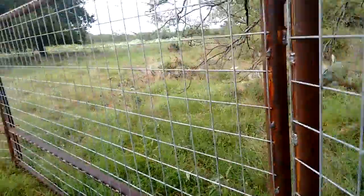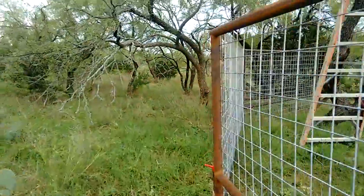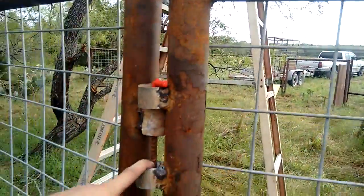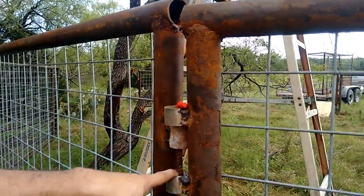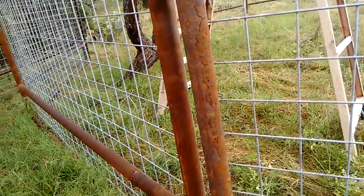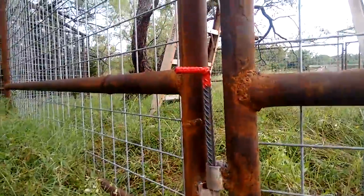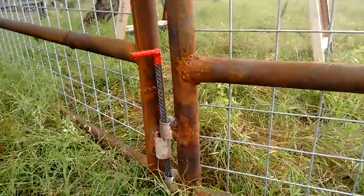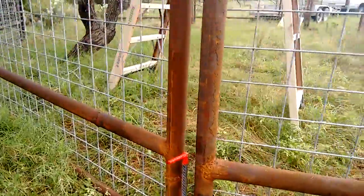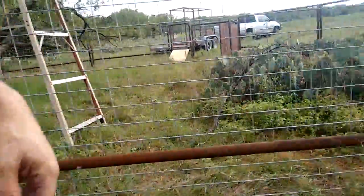These pins down here — let me show you. This is one of the holes I left open. In the top I've got just a small pin, either three-eighths or half-inch rebar. Down here I'm using five-eighths. When I get it inside exactly where I want it, I'll pound those into the ground a little bit. There's about six inches of space there so it can go down into the ground. I didn't want them being able to just start pounding the heck out of the thing and making a tight V, because if there's a tight corner they start piling up on each other and they'll climb out.